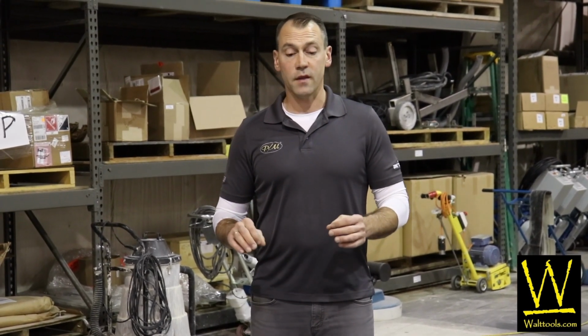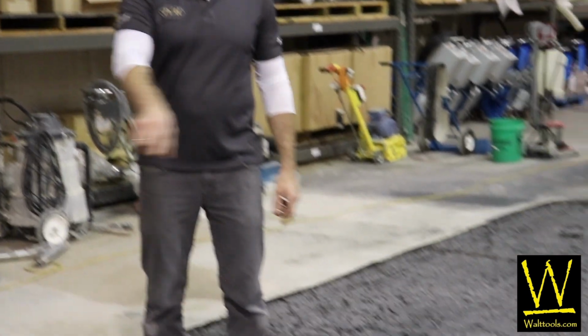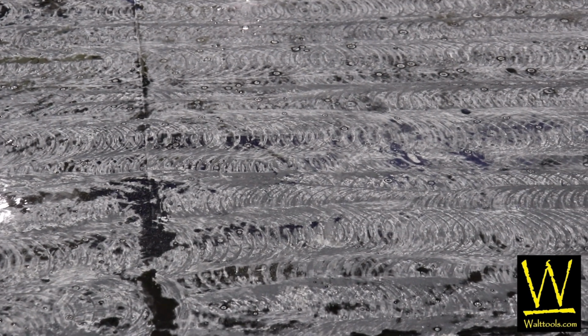So the improvised part that I wouldn't do in the field would be this, unless I was prepared to 100% grind it. And that also means that it would have to be so perfect that if I run the grinder over it and I see shiny spots, like I do all through the floor, if I see any shiny urethane, that means my diamond's never touched it, which means my coating will not stick to it. So that's why I would strongly recommend not to use a urethane like this, unless I knew, like if I was filling a crack or a nail pop, that when I run my grinder across it, it all changes to a monotone color, that everything matches where the diamonds have hit it. Anywhere it's shiny, it could inhibit the bond.